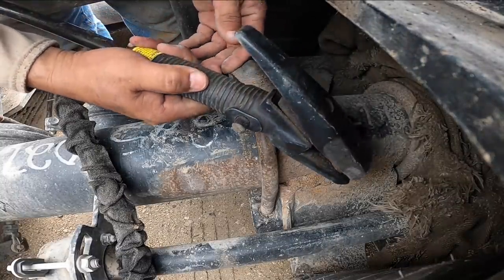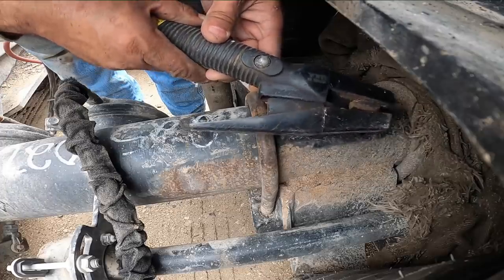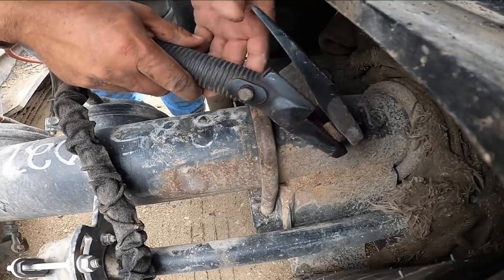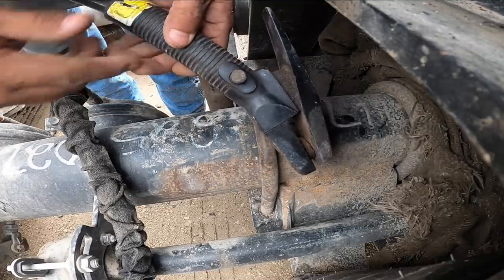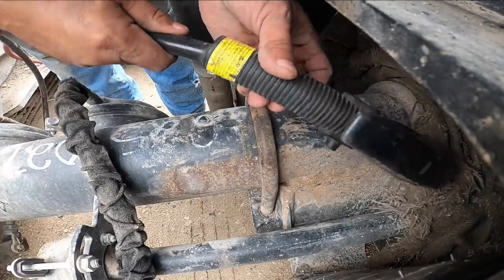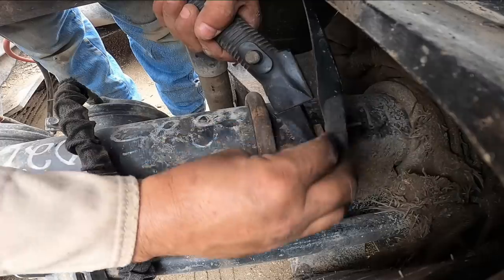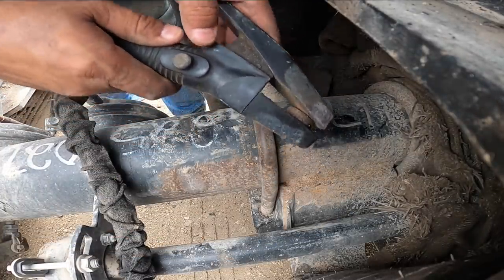This is the gouger I'm using. It's a Profax, very similar to the Arc Air. Profax is cheaper though. And this is a 4001-1 or something like that. The dash one, I believe, gives it a swivel. But I like the 3000 version because it's a flatter unit and you can fit it in tighter spaces.